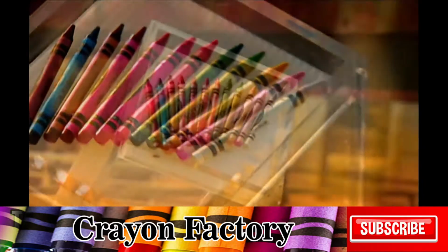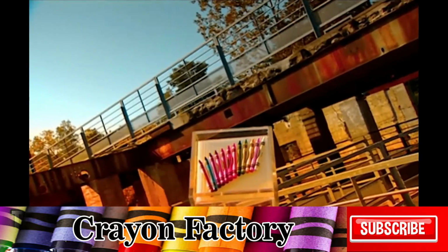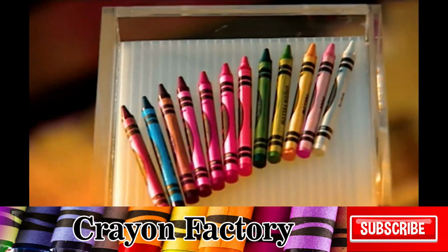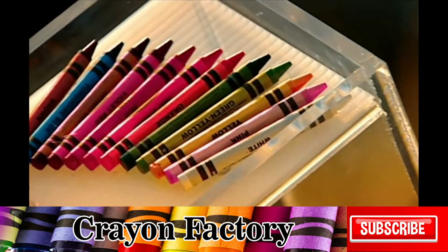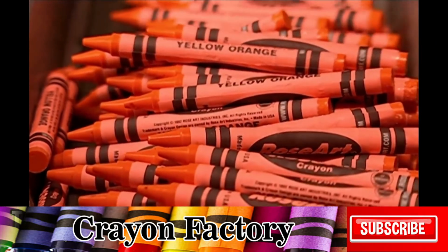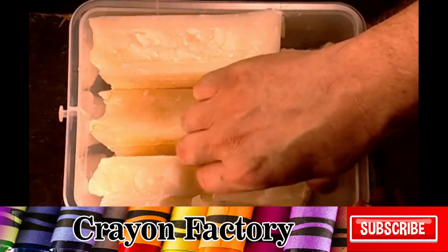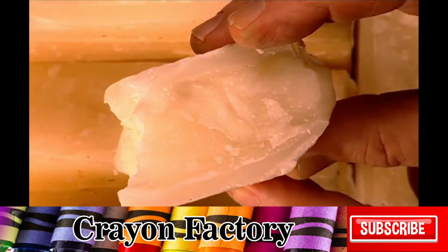They were invented in America in 1903, when a non-toxic version was created from the basic wax crayon already used for marking crates and barrels. We take a look at how colour is added to childhood. These crayons are made from a combination of waxes, primarily paraffin, which is ideal because it's inexpensive and easy to melt. It also has what's called a nice rub-off, meaning it leaves enough wax on the paper.